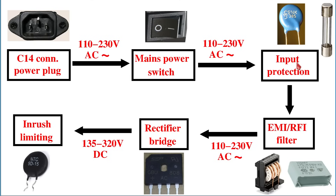Right after the input protection circuit, we go into the electromagnetic interference or radio frequency interference filter circuit, which is technically mandatory in a switch mode power supply. You might ask what the functionality of this filter is — is it to filter incoming power? What we actually want to filter out is the switching noise. As I will show later, field effect transistors generate lots of switching noise, and we want to filter that out so it does not get back into the power grid and disturb all the devices connected to our household.